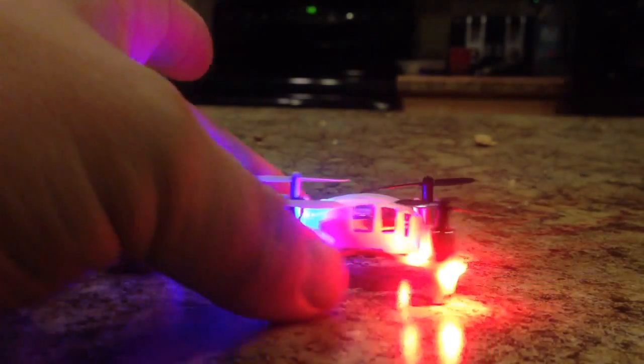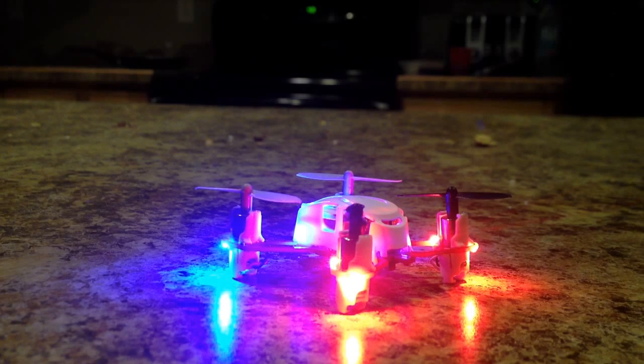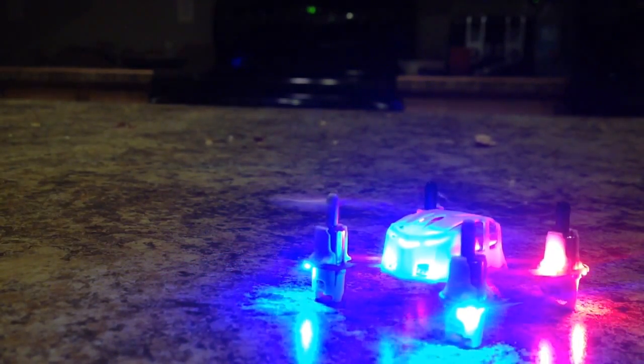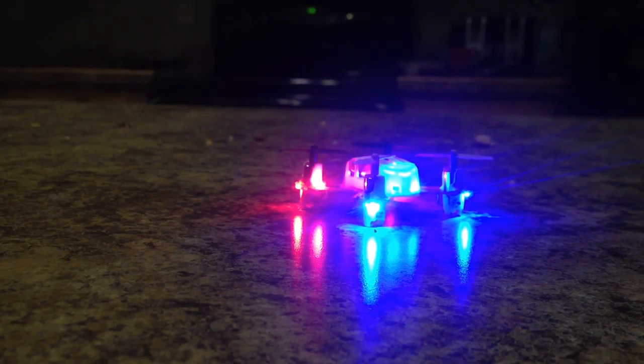We've got the motor harvested. First time powering this on — turn on the radio and calibrate it by putting the left throttle stick to the bottom right and flickering the sticks. See that little flash? That means the gyro is now calibrated. We'll puff the throttle a little to make sure the motor is spinning good. Looks good — doing a full pirouette on the counter. Light hover test looks good too. You can tell if motors are going out because they'll make an unfamiliar hum, not the normal mosquito sound.